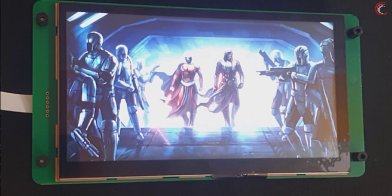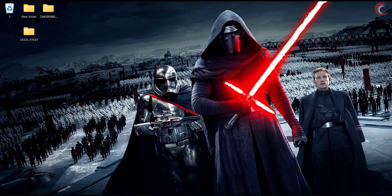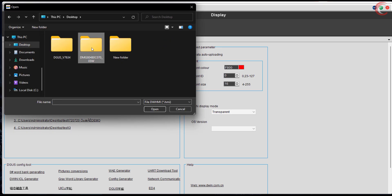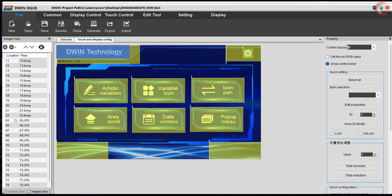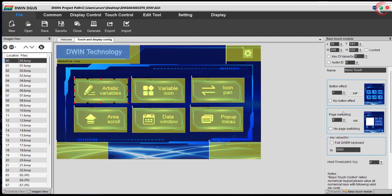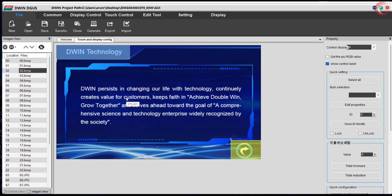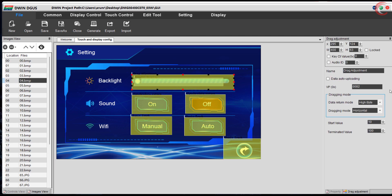You can see the page switching is working very well. The display quality is actually very good — my camera doesn't seem to capture it well enough. The touch response is also great. Overall the display is fine, and the software experience so far seems good. Their documentation is also good, so you don't have to search for different things. If you want to learn more about creating more detailed and complicated projects, simply download the factory demo first and load it in the DGUS software tool. You can see the number of screens, explore element properties, modify them, do some experiments, then save, generate, and load the project into the LCD.